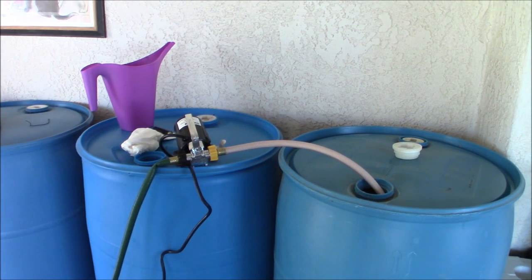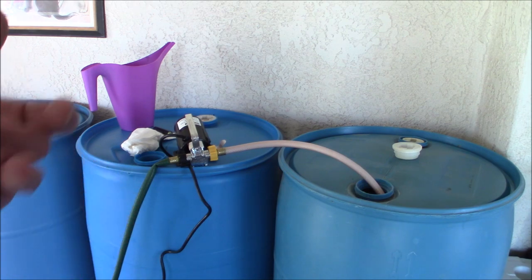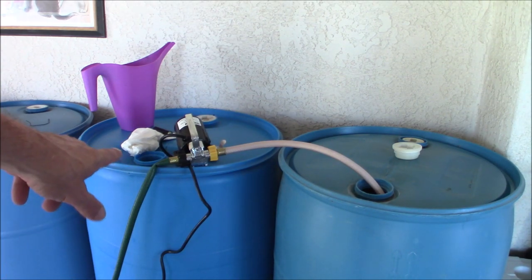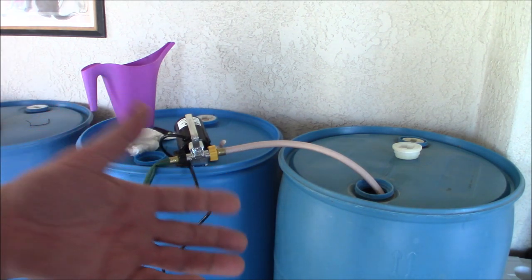In the package you'll get the utility pump, the six-foot hose, the plastic suction strainer, an extra set of brushes and one impeller, and an English user manual that's actually pretty helpful. It's 5.79 pounds. Product dimensions are about 8.9 inches by 7.5 inches by 9 inches, so it's very compact and easy to carry. They run about $56, and the time savings is immeasurable. They do about 5.5 gallons per minute — pretty good even with a crummy kinked hose. That's going to save me a ton of time, and time is money especially when you're preparing.